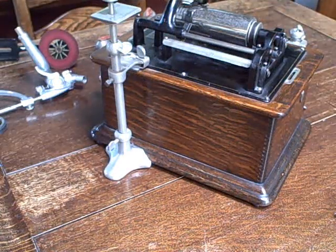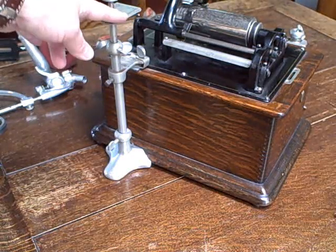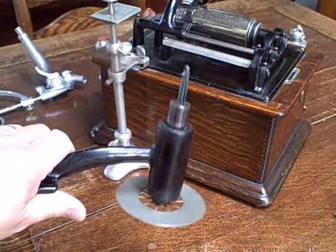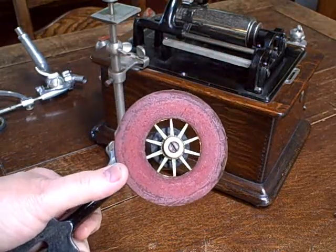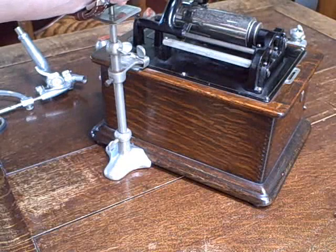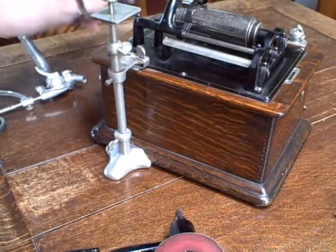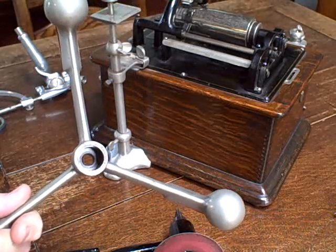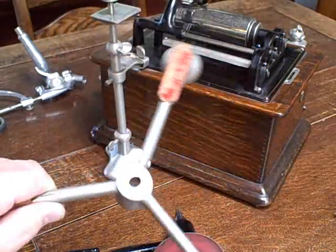The Biophone attachment consists of several individual parts, starting with a bracket which attaches to the rear of the phonograph, and then a cast iron bracket with a flexible spoked wheel that has leather padding on the bottom for friction. And this piece fits on the bracket and supports the turntable, which is cast and has large ball ends for centrifugal force to create something of a flywheel.